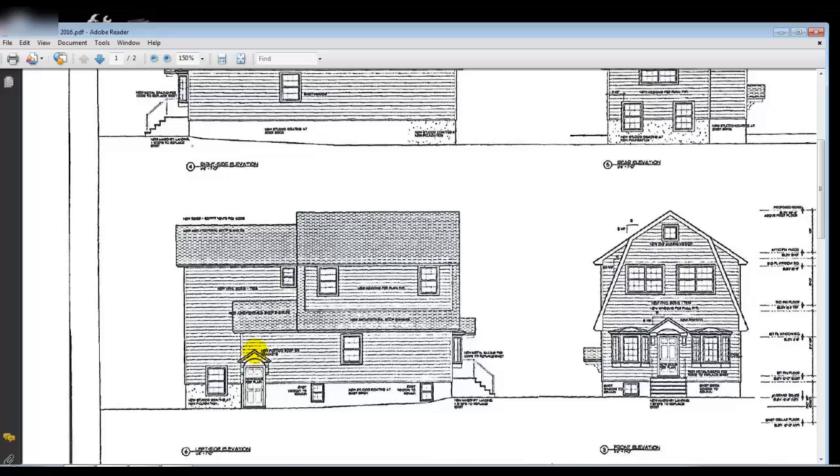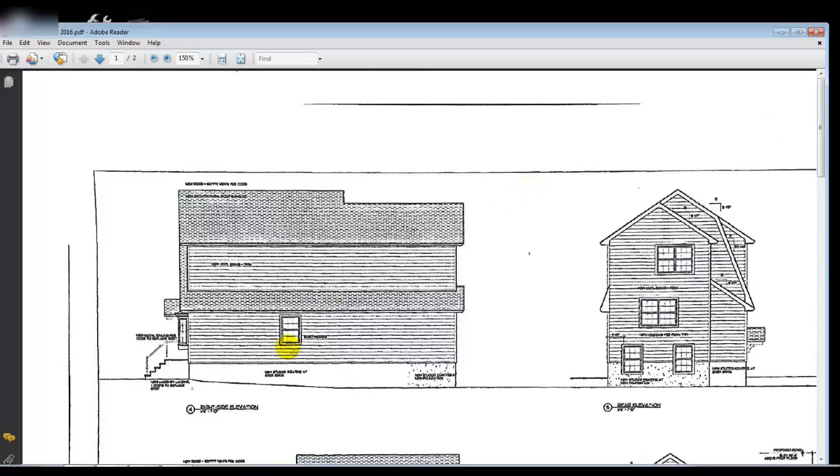On this side there are no windows — this is a side yard setback with a fire variance due to the proximity to the neighbor. The existing conditions don't need to change, but anything new on this wall must abide by code — no windows allowed. It also functions as a firewall, which means any new work on this side of the house gets two layers of fire-rated sheetrock.